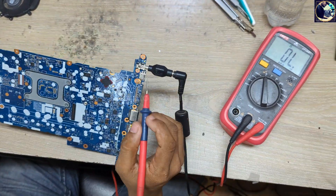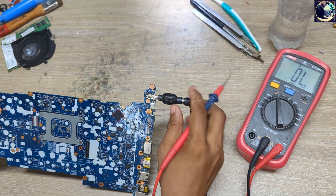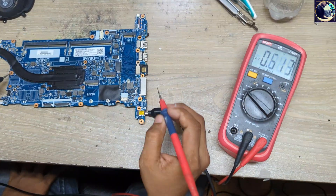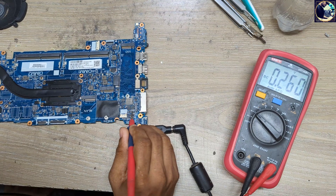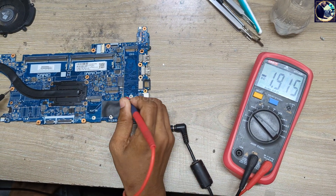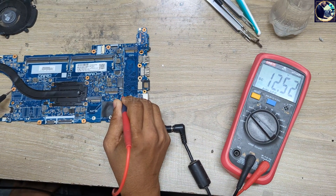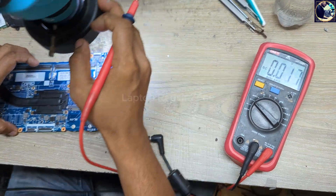Now I will plug in and look at my power supply — it's not taking any ampere, and only an orange light is blinking. Let's check some required voltages. First I need to check 19 volt — okay, it's present. Then I need to check 12.5 — this also good. Next I will check 3 volt and 5 volt always on voltages.